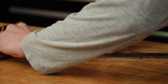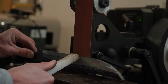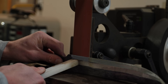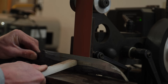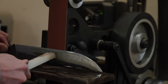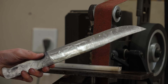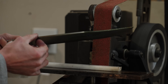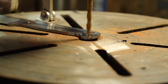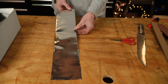There were a couple of design elements I was going for. First is an almost comically long but thin blade with an upswept trailing point profile. This is so that when you're batoning, the wood doesn't slip off the point. A drop point is a no-go for a batoning knife — you want a flat or slightly upswept spine to catch the wood. I went with a full flat grind rather than a saber grind. Stock thickness is around 140 thousandths, or 3.5 millimeters — pretty thin for a blade that ended up at 10 inches with a total length of 15 inches.